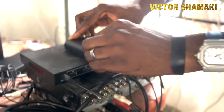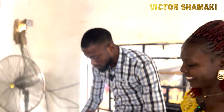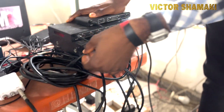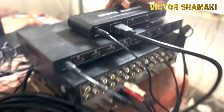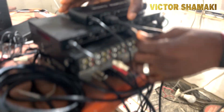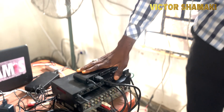We have our HDMI cables. The key rule is: always connect from output to input. The first HDMI cable goes from the output of the HDMI switch to the input of the HDMI splitter. So anything showing on the switch comes into the splitter.